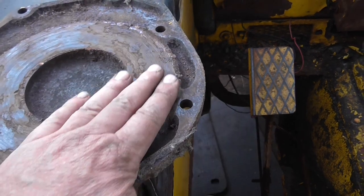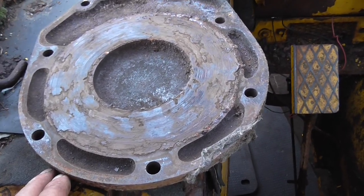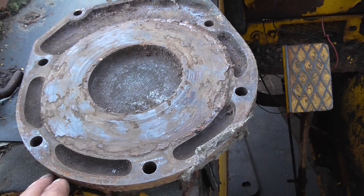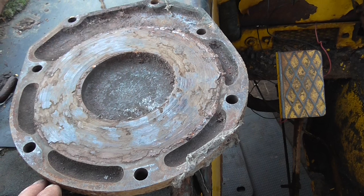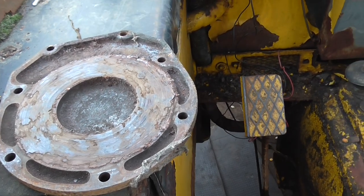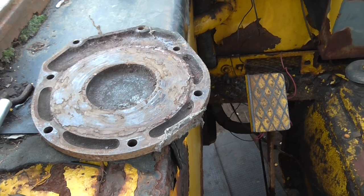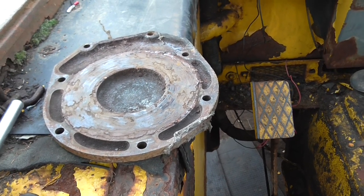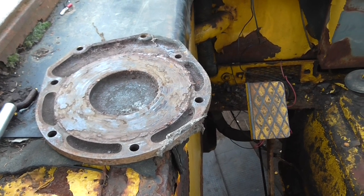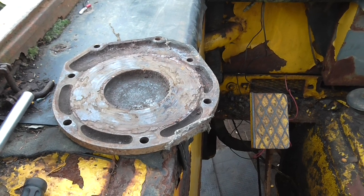As you can see, it's in a hell of a state. This will have to be remachined, or a replacement plate — even if I can get an older one — but it needs replacing. I'm guessing both sides are the same, so both need the same treatment. I'm going to fit softer compound friction discs as an experiment on this machine. These machines are always known as having poor brakes, but I'm going to try and improve it with my own modifications.